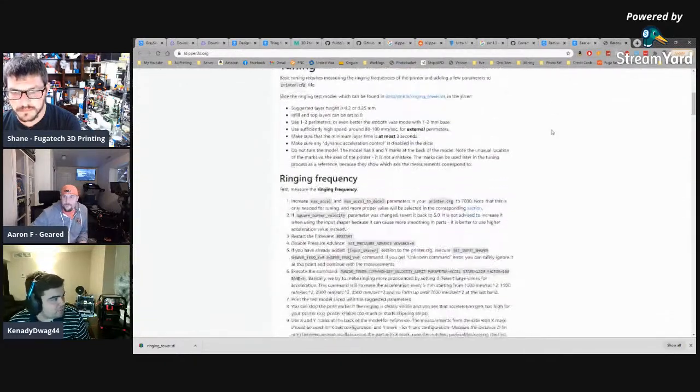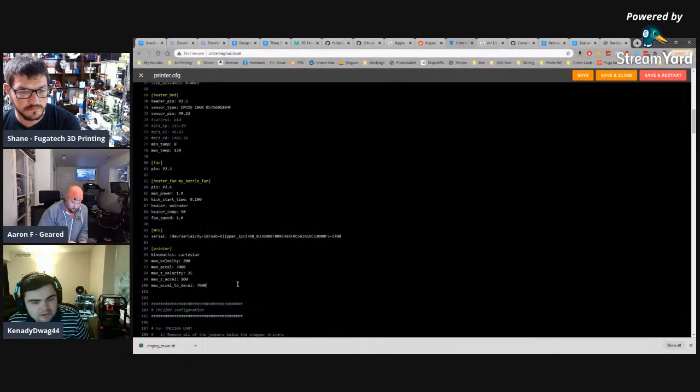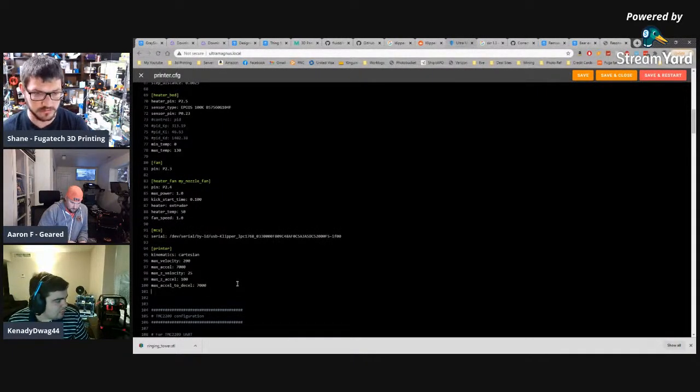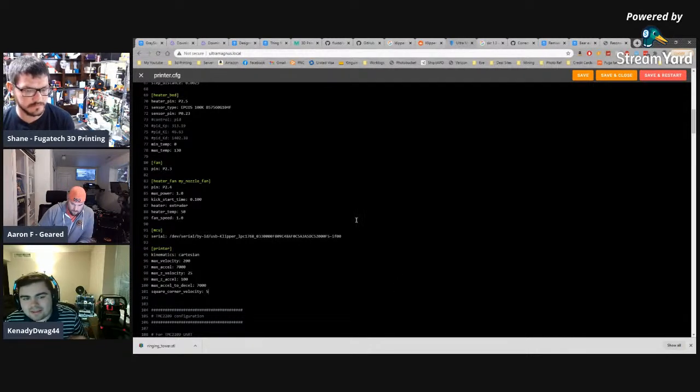Okay. And then I'm pulling up the second. We need to set your square corner velocity, which I think you're going to have to add to your config. I don't see it in there. I don't think so. What's it called? I'm looking that up right now. It's just square underscore corner underscore velocity. And okay, set that to 5. Now, is that the same as like jerk? Yep. It's not exactly the same as like Marlin jerk, but it's the same concept. So, yeah, it's the speed between those as it changes. And then you're good to go there. So you can save that and restart.